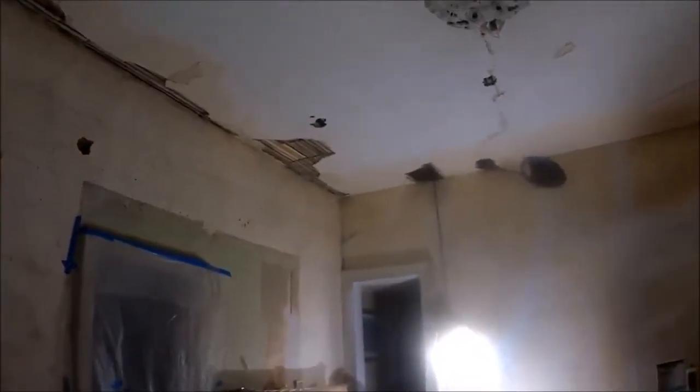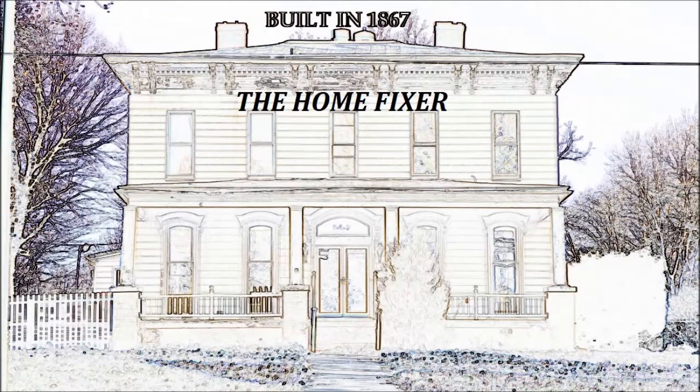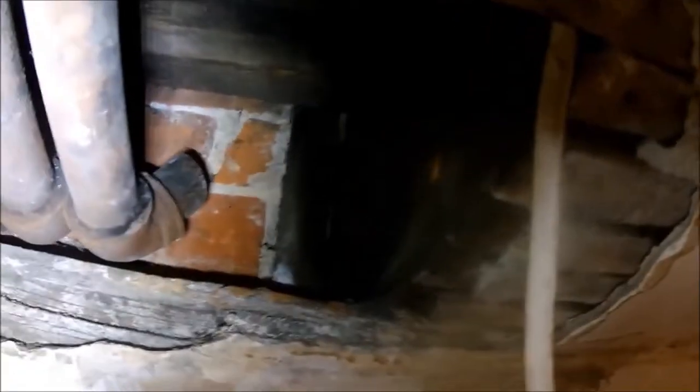Check out the video on the steps I had to do to fix that. I decided to drill a three-quarter inch hole through my rafter around my wire. The only problem is I have to break the ceiling up every 16 inches on center. I drilled the hole in the first two beams and got my electrical cord through.